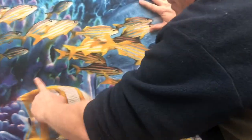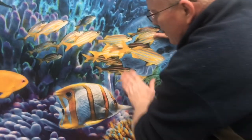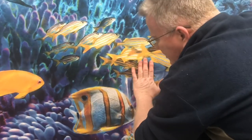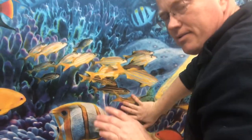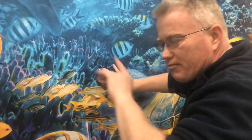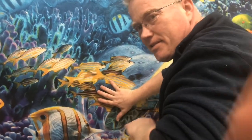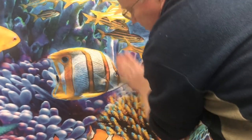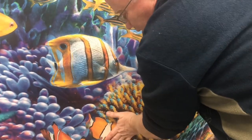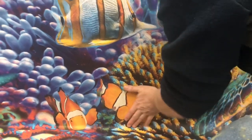We have a rounded shape here, and those are the hardest to match, because you'll be like, what's going on here? You'll move it up, it'll match, and then it'll be down, it'll be off here. This is what I suggest you do on rounded pattern matches. You simply move it either to the left or to the right. And that's usually the culprit that causes the issue.